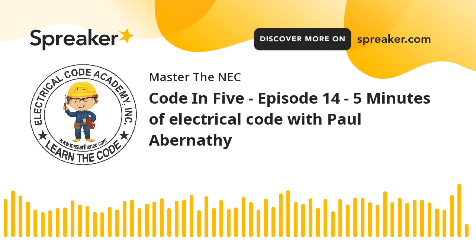First things first, let's set the tone. I have a transformer — it's a 480 volt delta primary and it's changing over to a 208Y/120 secondary. So on the primary side, obviously to ground, we exceed 250 volts. In fact, in a delta primary at 480 volts, that would be 480 volts to ground.